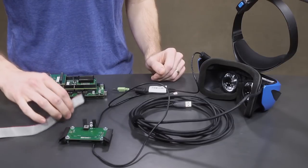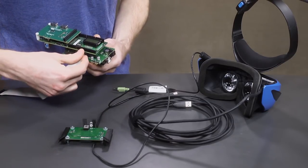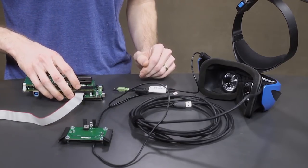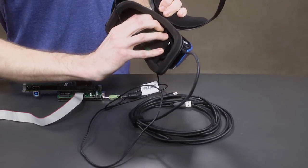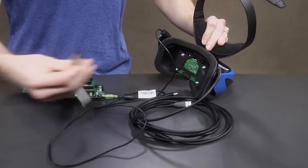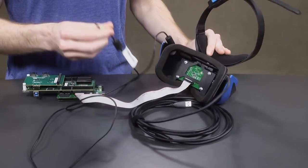Could you show us how we mount the HMD board to the HMD itself? We get the ribbon cable provided with the Exerciser and plug it into the HMD Exerciser shield. Before we plug this into the HMD board, we lock the HMD board into the HMD using a 3D printed fixture. Then we connect the ribbon cable, and then the audio cable.